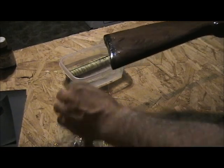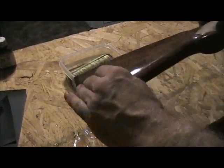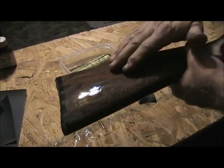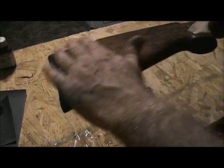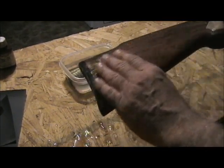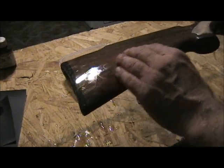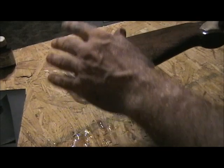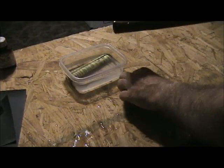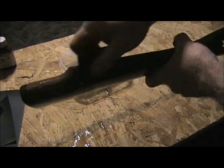Then you've got to go back and sand it again and get it even — this has worked really well for me in the past. We're going to sand it all the way smooth, and just from what little I've done already I can feel the difference. It's really getting down even. After a few times of doing this you'll get a surface just like glass on here — it'll be so slick and so smooth. What's good about this is if you get dings or scratches in the stock, you can go right back in, sand that down, use the True Oil, layer it on a few coats, and just blend it back in. It's virtually impossible to see.